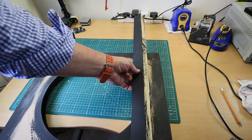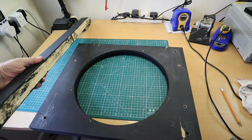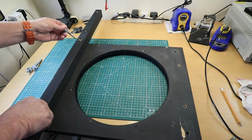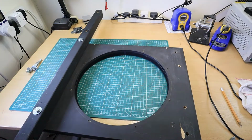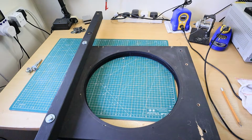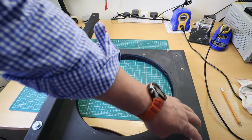and this forms the leg. And what we do, turn it over. This side is the front, this side is the back, and the leg bolts to the back via some of these bolts with a big penny washer. So the penny washer fits through the baffle plate and screws into the nutsert. Just like that. Do these up. There you go. So you end up with a nice solid chassis leg, nice solid baffle board. You would then put your other leg on, obviously.